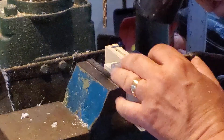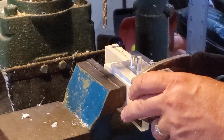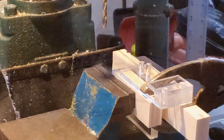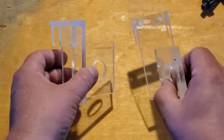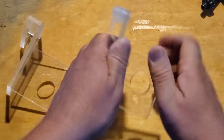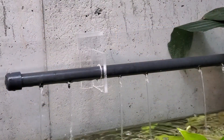I'll do a fair amount of this off-camera now since it's mostly a repetition of what you've already seen. I'll drive the peg down far enough, take the whole assembly apart, use a piece of plywood to drive the rods fully seated, then cut off the excess rod. As you can see, not a drop of glue is used, no welding was done. The only real difference is the part in my right hand is twice the thickness to allow for the rod diameter — and it's actually quite aesthetically pleasing.